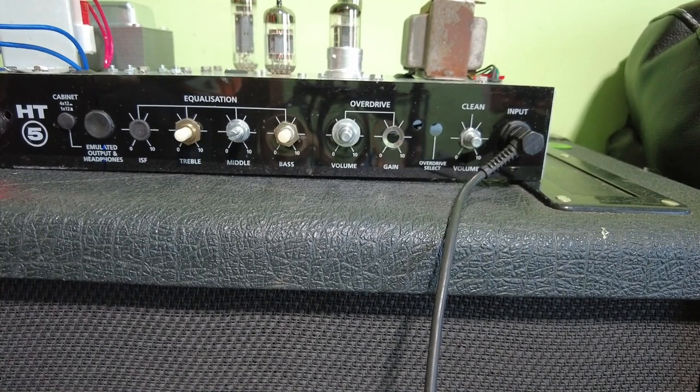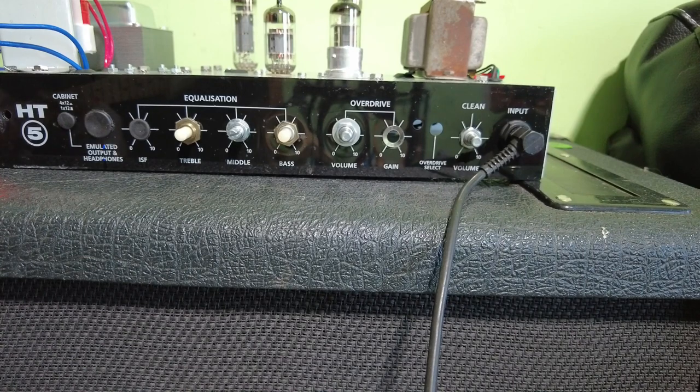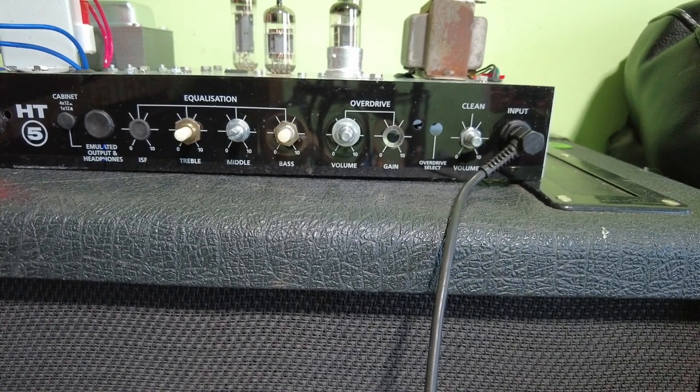In part two, we're going to get some knobs on this amp and we're going to change one or two components in it and try and get it to sound a bit sweeter. But basically we have proved that we can take these television tubes and build a guitar amp with them. I've seen that done in hi-fi amps on quite a few forums, but I've never seen anybody use them in a guitar amplifier. But you can match the voltages up and balance the gain on them.